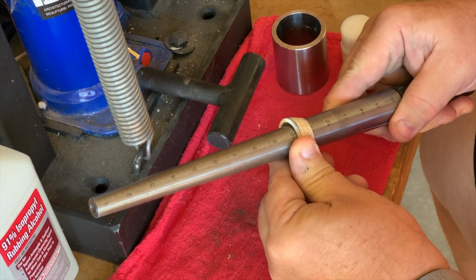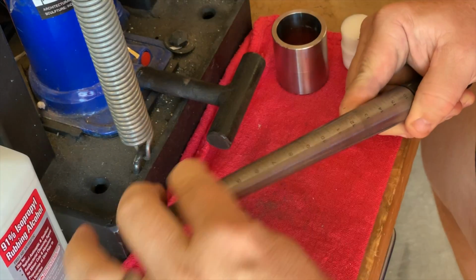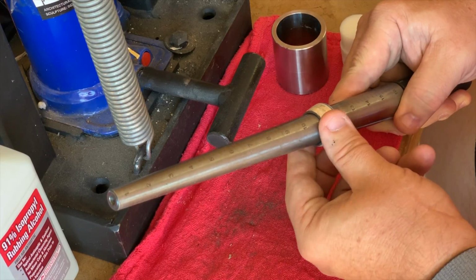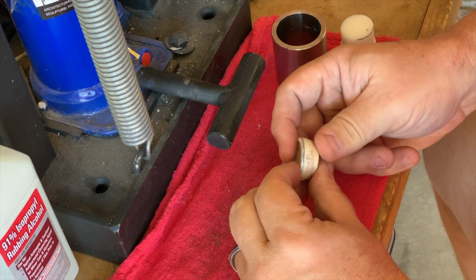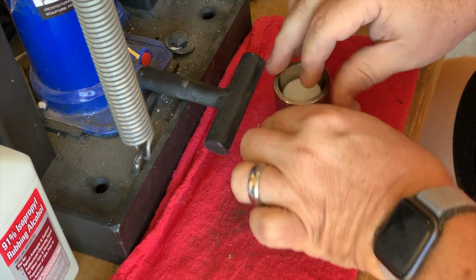This is a good time to check my size. Remember, we're looking to be about 2 sizes above the target size so that I have room to put a bulge or fat tire into the ring. Now I know where I stand. I've made the decision I will push the ring all the way out through the bottom of the die.